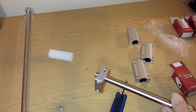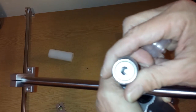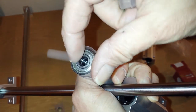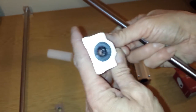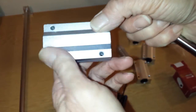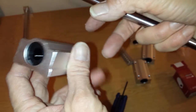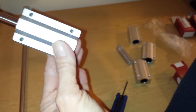The only exception will probably be these sorts of things, the shielded ones. The reason being is they are generally sealed in a controlled environment, and packaged by a machine before anyone can get their hands on them. Whereas these are quickly machined, dumped in a bin, then coated, and then someone comes along and physically shoves a bearing in there by hand, probably with a block of wood to smack it in with. Anyway, this is the clean one. Let's just try and see if we got an improvement.